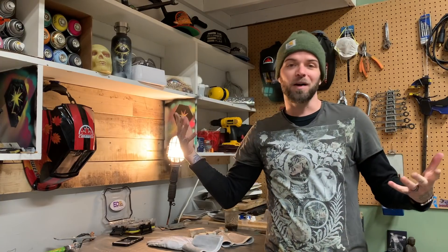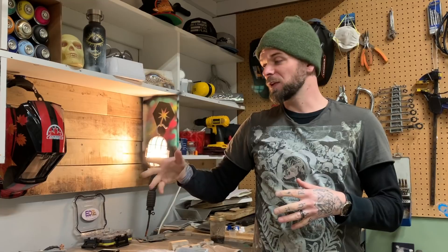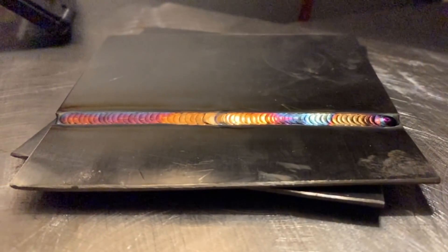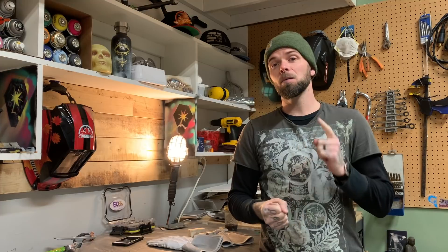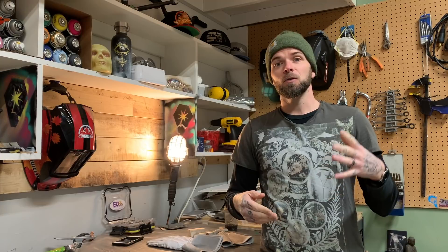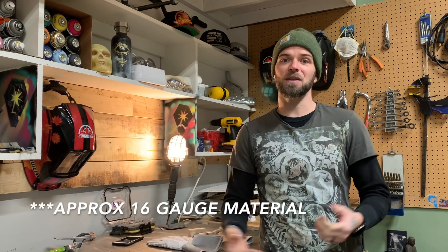Overall, those were fun — just goofed around with some super thin material. Because the material was so thin, I probably would have set up a few things differently. But for doing just two passes and totally sending it without any warm-ups, they turned out okay. I would probably increase my gas flow to about 20 to 25 CFH on the regulator, use a bigger cup orifice with more gas coming through it — I switched to a 15 cup for that last one, which was more in the ballpark. I would also increase my travel speed quite a bit to help prevent heat from building up in the material. We're working with material that's about a sixteenth of an inch thick, so pretty thin stuff.